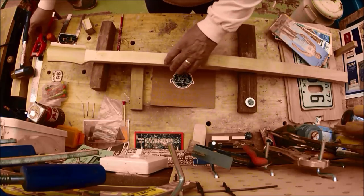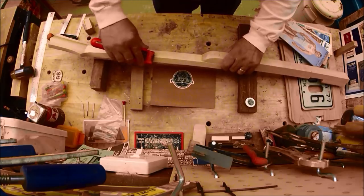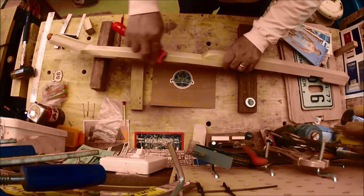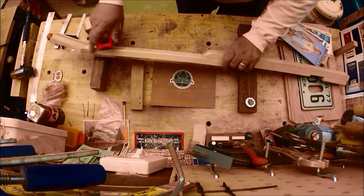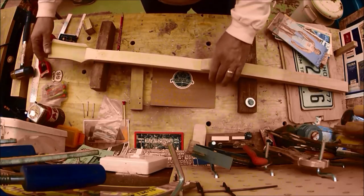If you're working a slide, they always tell you keep your fingers underneath, sliding straight up and down. That helps you with that. And it kind of looks a little bit more rustic, but I can take a Surform or a light plane or something and go along and get this rounded off like so. I've got some more work to do here. I just don't want anybody hanging up their hand and do both sides like that. And there's more work to do here.